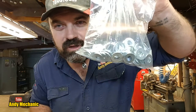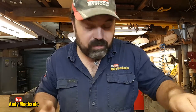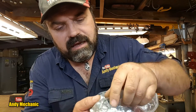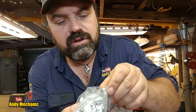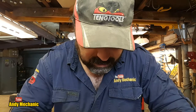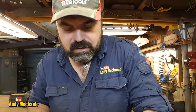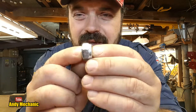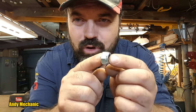We've got a lot of heavy-duty washers, again with a 12mm hole, which I use a lot of, on both sides. We got M12 Nylocks, and these look like the medium nut version. Yeah, these are the medium nuts. Because there are three different types of Nylocks you can get. You can get a shallow one, almost like a half nut, then the normal one, which is this, and then a deep nut, which gives you additional thread depth for more torque, I suppose.